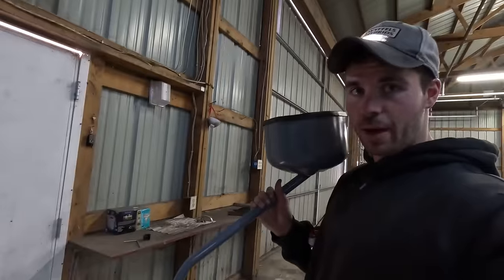We pulled three clays out, pulled them both out, then put two ends on an 8-inch plastic, taped them together, and we think two of those three that we pulled out were kind of damaged, sunken, not feeding right. And then Grant's just putting a little protector on the connections. I don't know. Might as well throw it on while it's here and we'll backfill it. And I think this is more like we're in the P-trap of this tile system where there's always sitting water, whether it's dry or wet. But then when it rains, it flows. I don't know. Grant's gonna backfill it and we'll be good.